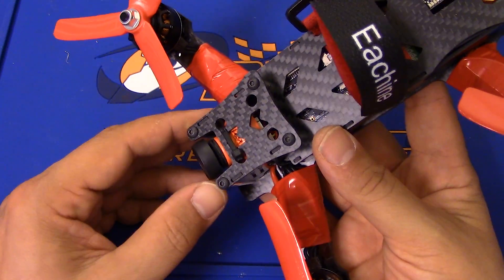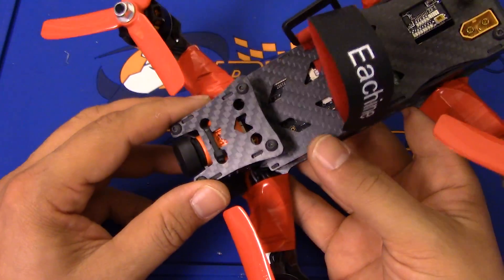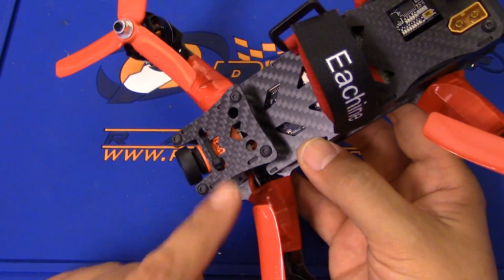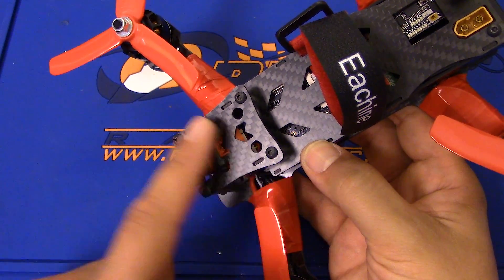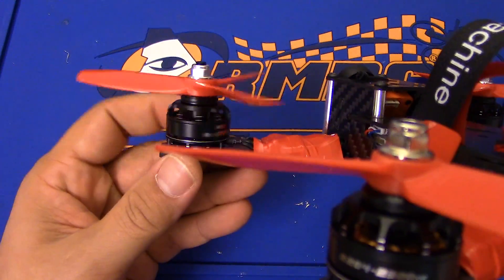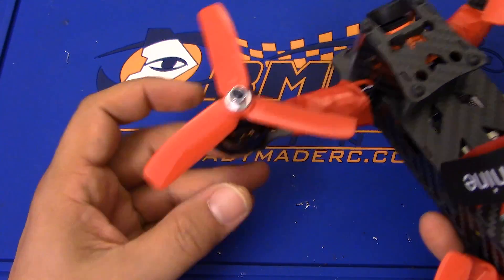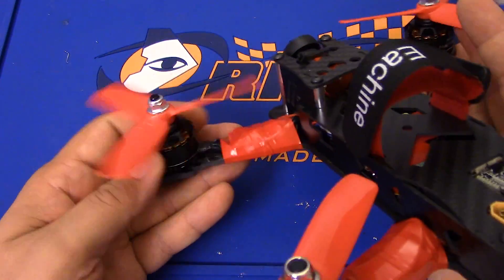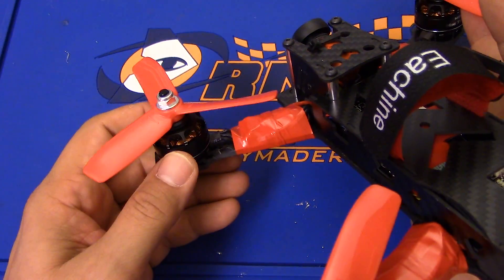I have been flying, very briefly, the 4.3 version of the Eagle on the Rampage frame, and a full review is coming, but initial results are that it is much better. The problems with the Eagle I noted I think have to do with the 16-9 lens and not the Eagle underneath. These 2204-2300KV motors are not ideal for 4-inch props - in my opinion, higher KV motors are better for 4-inch props, even tri-blades. They'll do, and because this is a beginner copter, they'll be a little underpowered, but for a noob, that's okay.